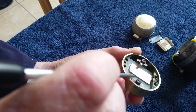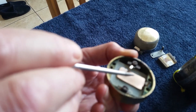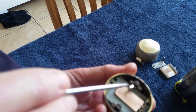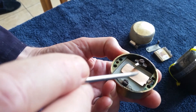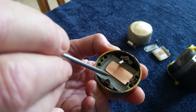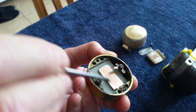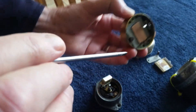I chose to use araldite underneath just to hold everything so it can't move — though I don't think it was necessarily required. I then attached the solder tag, waiting for me to solder this into position. By removing the old condenser and putting a single piece of fiberglass board in the bottom, it lines up nicely with where the original fixing hole was, horizontally. That's that piece modified.